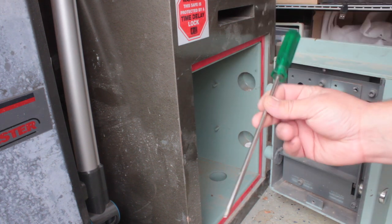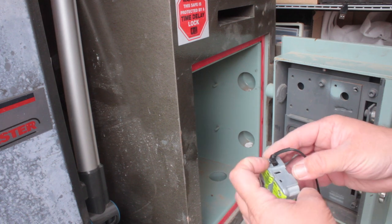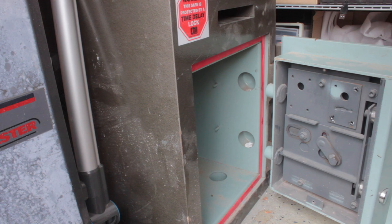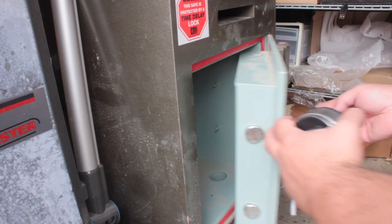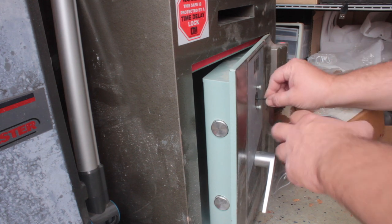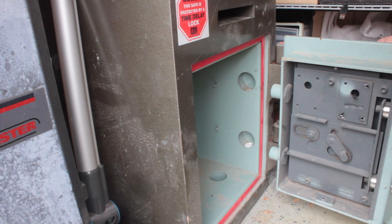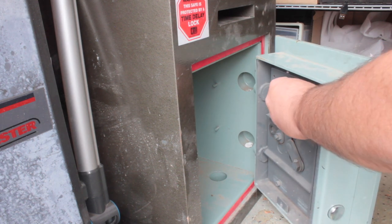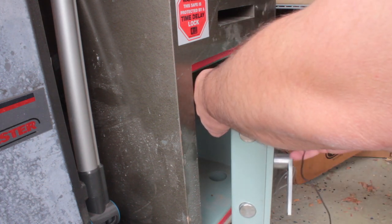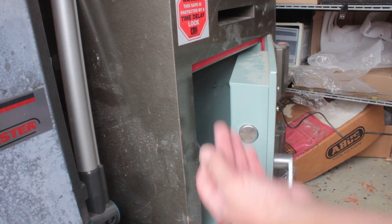I have to use one of these big things, one screwdriver to put all this back. I'm going to disconnect my cable here by pushing that black lever down. I'm remembering the spot, it's the outer one. And the first thing I need to do is feed this cable through. Just push that through there. Do a little twist, make sure it centers. This will be the first time this safe has actually been lockable. Now I just need to pull that cable through without wrecking it, so just bit by bit, and I'll even cable tie it all together.